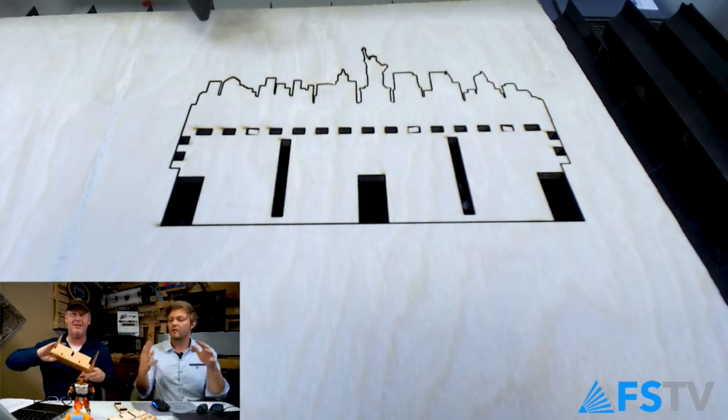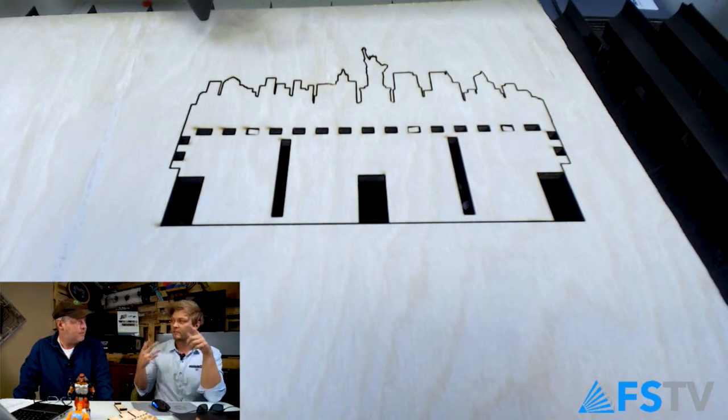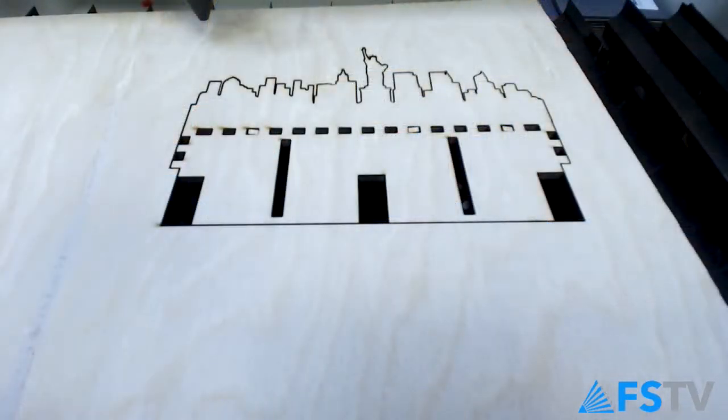Yeah, that's cutting good. So with acrylic, you have to get acrylic binding glue, which is a special glue that you can order online. Made just for acrylic? Just for acrylic. And it's invisible when it hits acrylic? It's invisible, and it just beautifully molds them together. What it actually does is kind of melts it chemically and then bonds them together. So if you've seen fish tanks, the seams are very clean and don't look like some sort of super glue job. It's actually that special glue. Okay. It sounds expensive. It's not too bad. Oh, okay, good. So we'll take this guy out. Project's done.